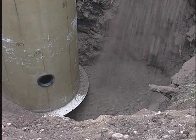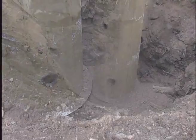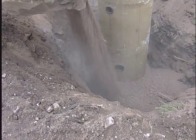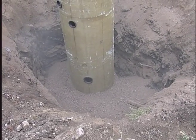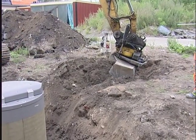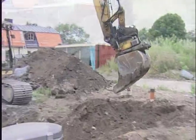This size of top station is equipped with a flange around the bottom part. The filling material above the flange prevents the pump station from floating up due to the lifting forces of the high ground water level. After anchoring the station, preparations were made for the connections of the pipes to inlets, outlets and power supply.